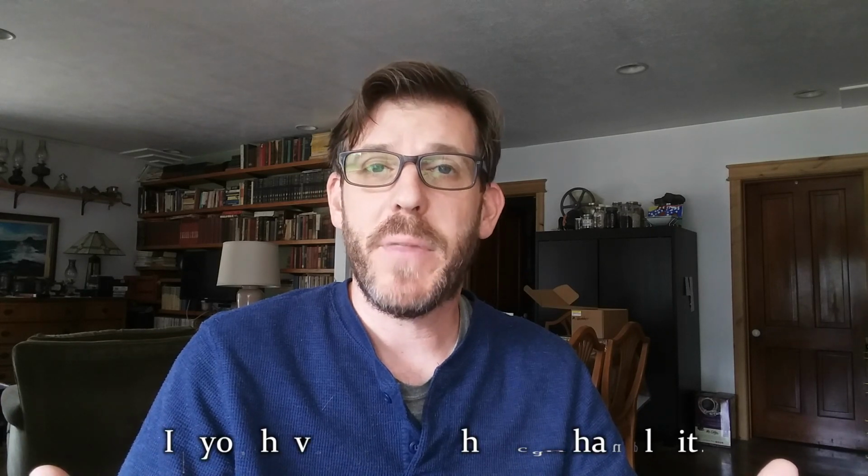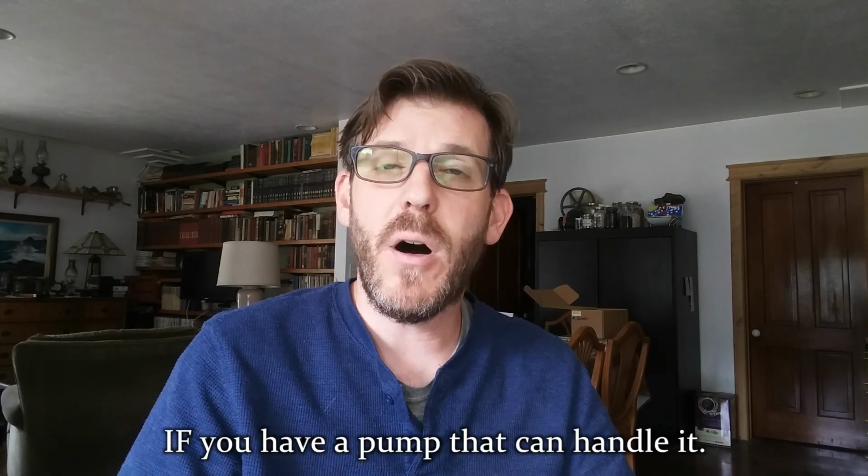Now, there are a whole bunch of theories and ideas on what to do about a pressure tank: buy big or buy small. But the one thing you need to do is buy the right size, and that's needless to say. You can buy big and you'll be fine if you have a pump that can handle it. You can buy small, but you've got to make sure that all the faucets in your house can maintain the same pressure. You have too many faucets for a small tank, and the pressure will drop as soon as someone brushes their teeth while you're washing dishes, or as soon as someone flushes the toilet while you're in the shower.